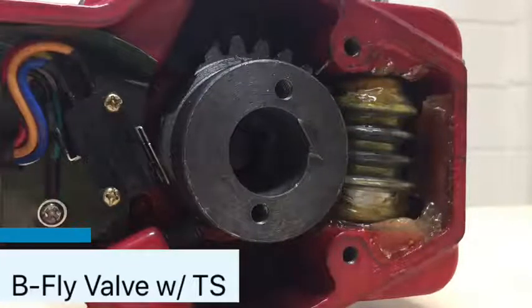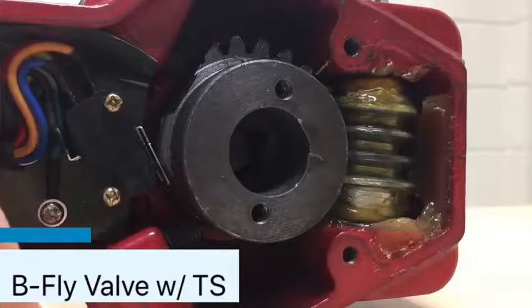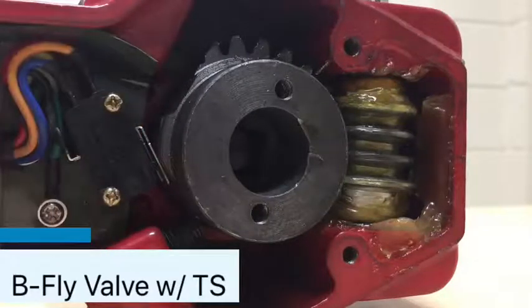I'm not saying one way or another what you need to do. I'm just telling you about the components associated with it and the common failures that happen. The micro switch is by far the most common failure on these valves — just something to consider as you're moving forward. That right there is a butterfly valve with an integral tamper switch. Hope you guys found it useful — please reach out with any questions, and happy to take pictures or whatever you guys need to keep learning about these different components. Happy learning.